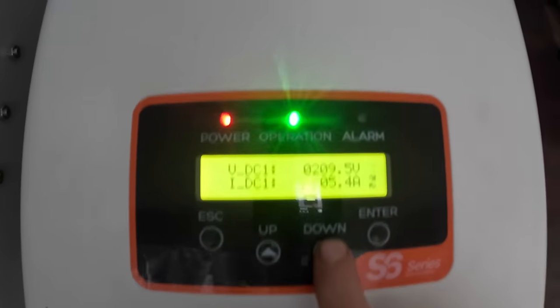That's a really minimal flow — basically a summer flow rate. We've got no splashing at all, literally just droplets. That wheel there is working at probably over 90 percent efficient. Obviously the efficiency drops off a bit as the flow rate goes up, which is to be expected. It'll work best in the middle of the flow range, so it'll work in summer and winter. Let's go and see how much power it's producing.